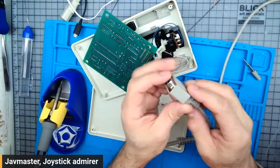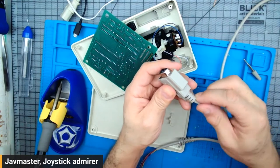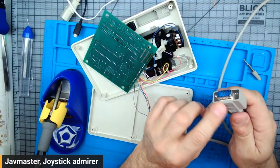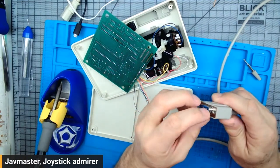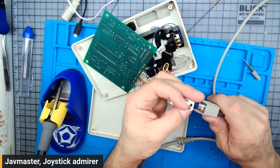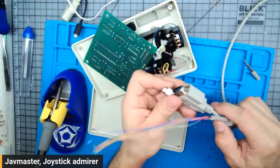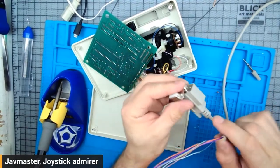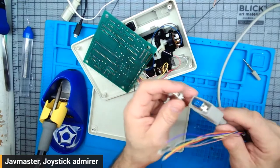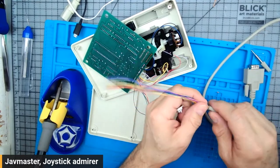And then when you do that, you can take out all the housing, the metal thing, peel it out, take out the cables, and then you can either reuse this one if it's possible, but normally they have inside a metal shield and then plastic melted, so it's very difficult. So just get a new connector, and then put the cables from here. And of course, you've got to test it before you solder it. So now you know that all the cables work and they go directly, and then reconnect everything. Beep, beep, beep. Most of the joystick cabling schematics are on the Apple II FAQ website.